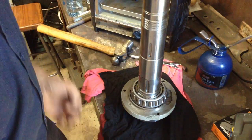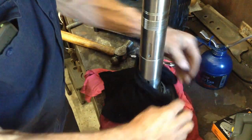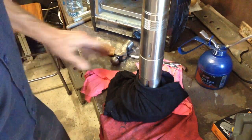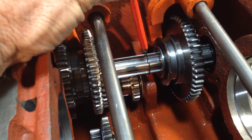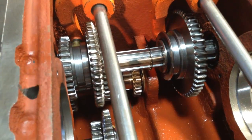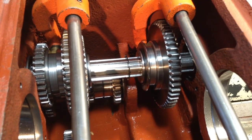So what we'll do now is cover that over, and when it cools down to room temperature, we will install it into the machine. That's that other circlip sitting in its groove, and that's the one I know a couple of you mentioned that I might have forgotten to slip into its groove, but no, I did that when I was checking the detents on the levers.